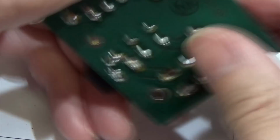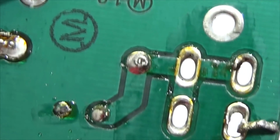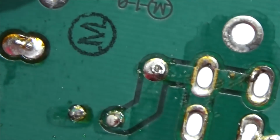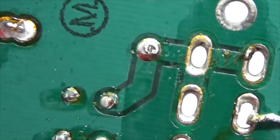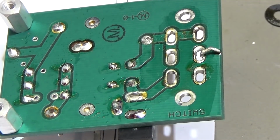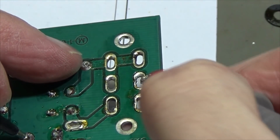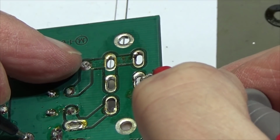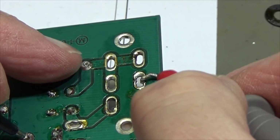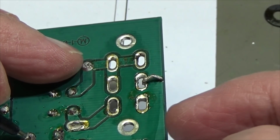Yeah, let's see. I still think it looks like a dry solder point, which we reflow, and then let's see how we can go ahead. And maybe one addition. With the switch off, and we go here to ground, and now to this whatever it is here. You hear that? So we definitely still have a connection to ground, which we shouldn't have. Is that already our problem?